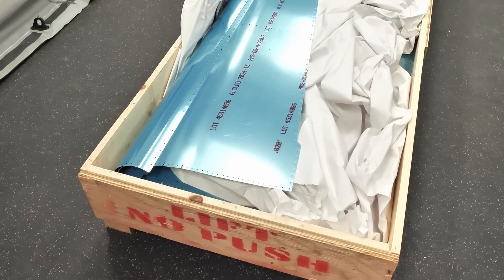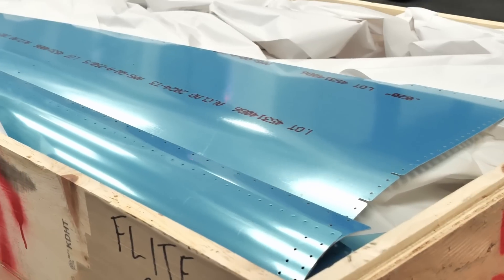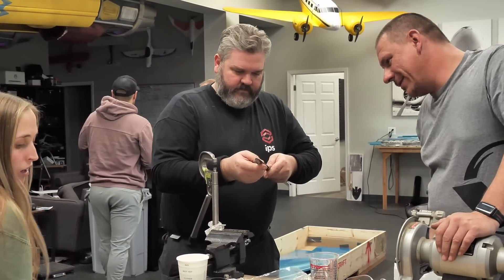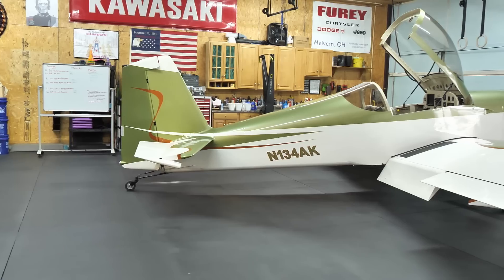One of the favorite things about the RV-12 is that it's pretty much all assembled using pulled rivets — pop rivets. Airplane kits have evolved over time; they used to require cutting metal from drawings, but now parts are all pre-punched using CNC punch presses with holes already at final size. You just need to deburr, then start clamping the airplane together — it's self-jigging, everything lines up. It's like CNC magic. Then you start pulling the rivets and assemble it.